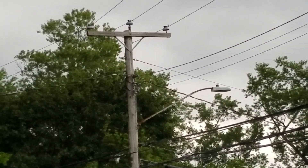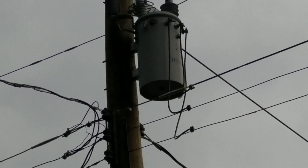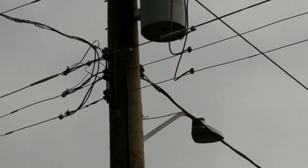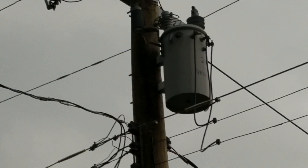The lower wires are for houses locally distributed in the area — this might be the only transformer for two, three, four, or five houses. What comes into your house is +120V and -120V with a ground, and that's what feeds to your breaker box. If there is a short for any reason between the pole and your house — which has breakers — then that fused disconnect will blow.